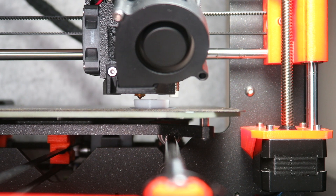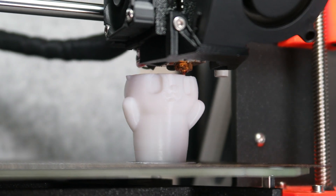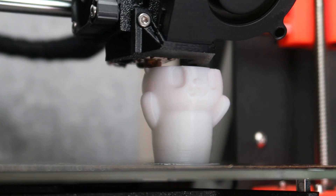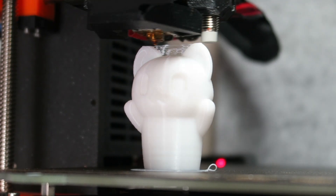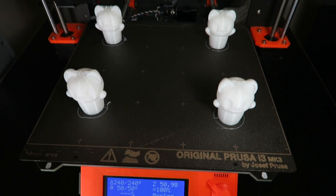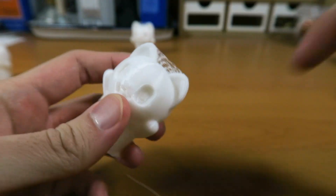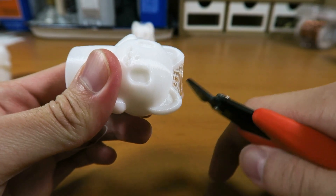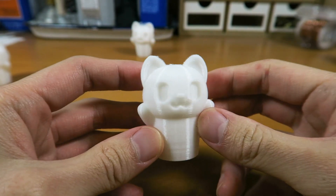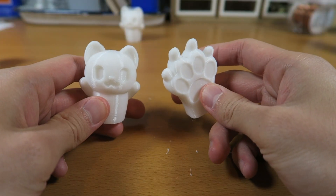For the 3D printing, I used a flexible PLA filament — I put a link in the description below. Using flexible filaments is tricky since you have to print slowly or it'll jam up. There's also some stringiness that happens, but I can clean it up later. It took a lot of trial and error, but I was finally able to get some successful prints. To deal with the leftover strings of plastic, I used my favorite pair of flush cutters. I did the same for the paw — that's better, all cleaned up.